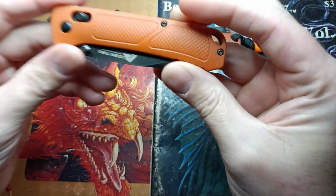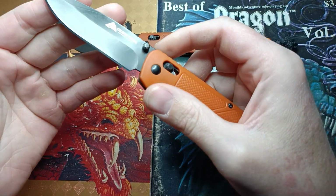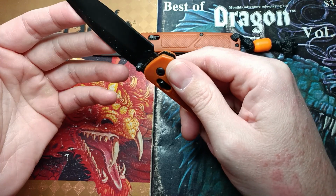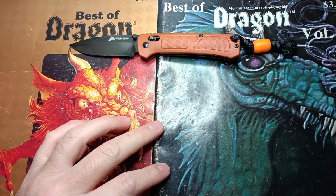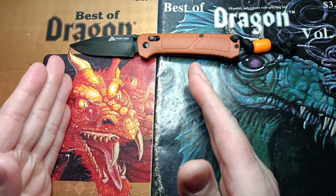And this one, we put at a way finer angle than is recommended for D2. We put it to 15 degrees. Still took 4.5 hours thereabouts to wear out. On a 15-degree edge, it was way too fine for something like this. So, I know these knives perform well. And this totally does not match up with what Outdoors 55 got on his.